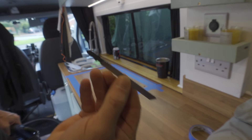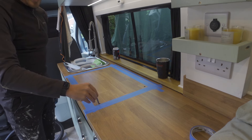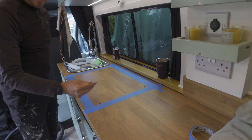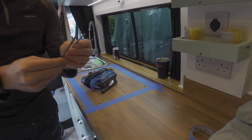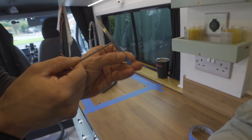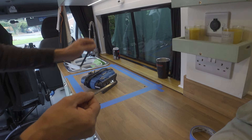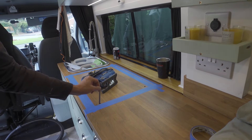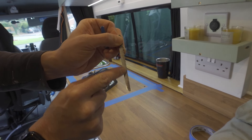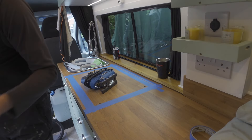Get yourself a nice fresh blade — it's a downward cutting blade. The clean cut will be on the top here, the rip-out will be underneath. With a standard blade the teeth go up, so it rips on top. This blade cuts on the downstroke — the teeth face down — so the clean cut is on top here.